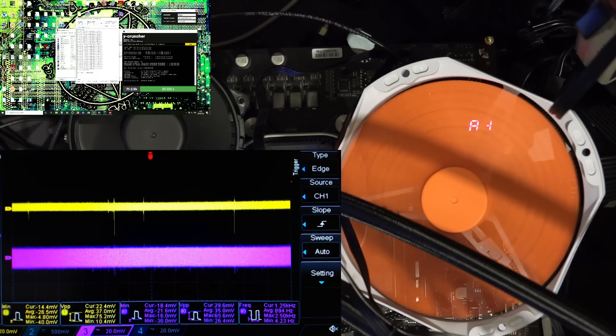Not only is the test methodology great, but the results are the same — so we've verified that things are the same with an extreme degree of precision, which is just... well, that's useful. The times I have noticed differences between boards, it isn't even a voltage thing — it's more like this board doesn't do what the other board does regardless of voltage, because it has an actual signal integrity problem, or a termination configuration problem, which is ultimately a signal integrity problem coming from badly configured termination settings.